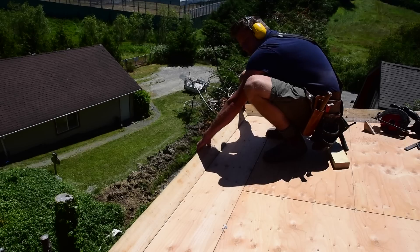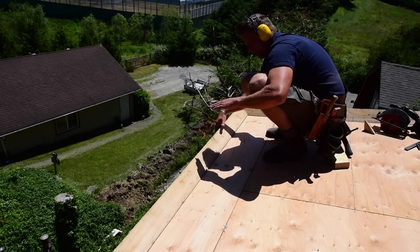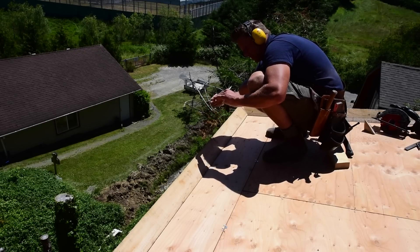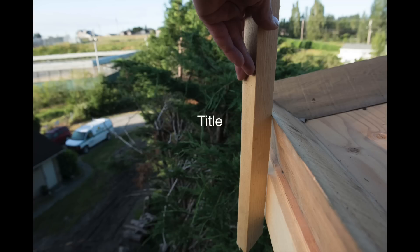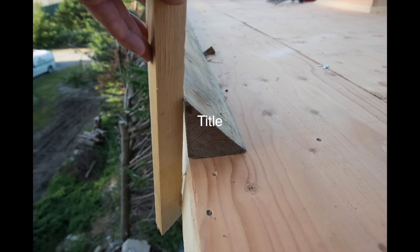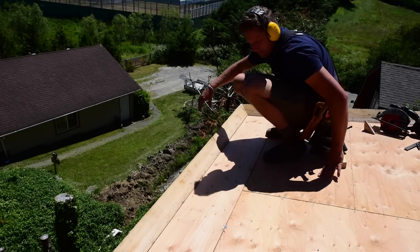Because the roof has an angle and the cant strip is 90 degrees right now, with my fascia being plumb, it would be sticking out a little. So I've pulled it back so it's in the plane of the fascia — there'll be a small gap behind. I'll run the cant strip flush with the framing over there and just trim or plane the back edge plumb with the fascia board using my power planer. That way I've got a nice slope — easy peasy.